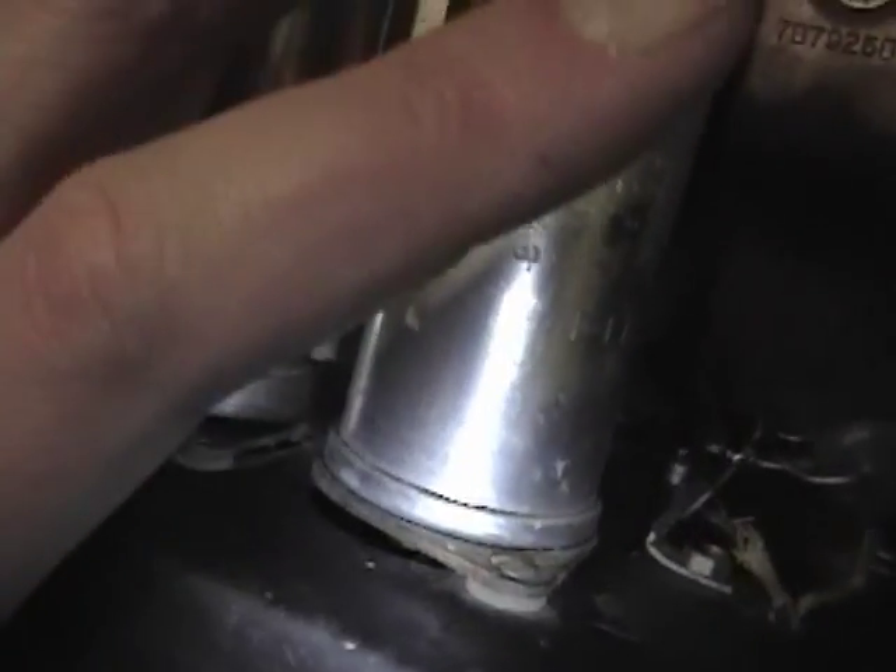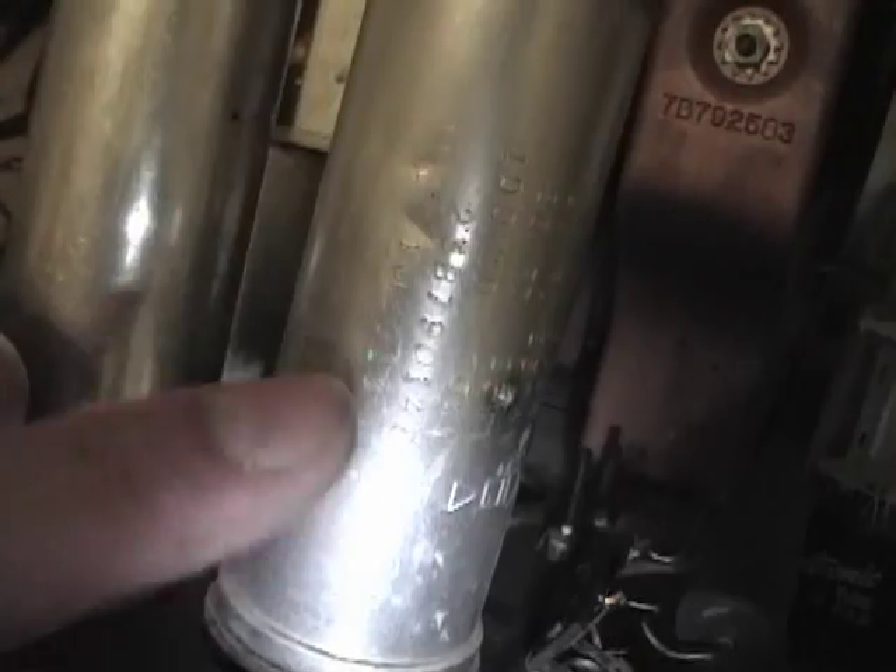I already got the one earlier. This is the one that had the broken base, and I found out that if I just wedge it back down it's actually pretty firm - I'll glue that up after I remove this cap. The tricky bit with this is that there's a lot of wires going to these caps, and a big part of the reason is that this set has a hot chassis. That chassis is just kind of a floating earth potential - it's not used for common ground.